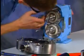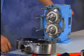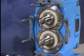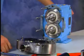Check the rotor end that locks against the shaft shoulder for wear, as well as the shaft shoulder itself. If this area is worn, a common cause may be extended running with a loose rotor retaining nut or repeatedly slamming the rotor in place on reassembly. If worn, the rotor should be replaced and the shaft should be re-shimmed to maintain the proper back face clearance.